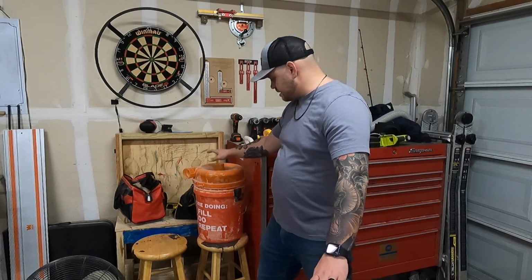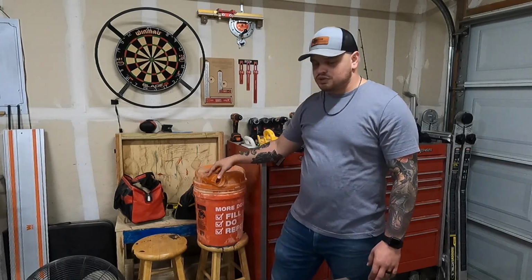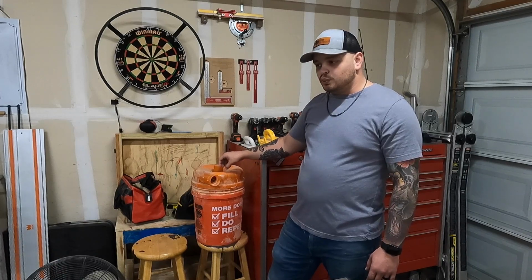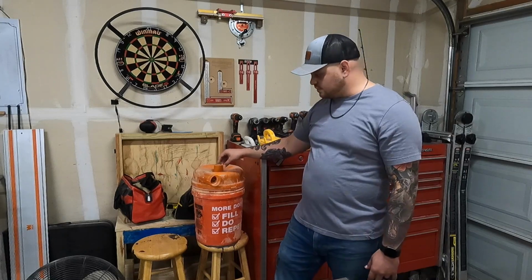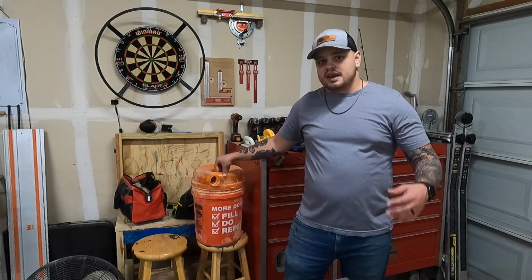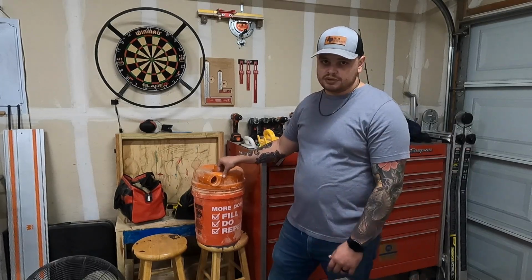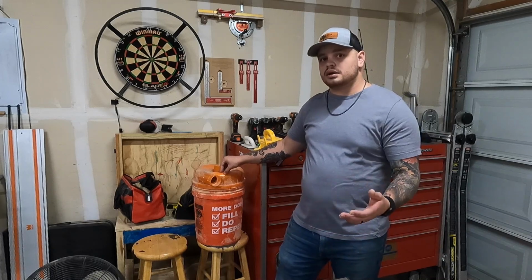And then I got my dust stopper, which was a mini cyclone that I got from Home Depot, attached to a shop vac. I like this. I would still use it if it had a bigger capacity. That's really the only reason that I don't use it, is it's only about 5 gallons. And any of you that have a big planer or jointer know that you go through that in about 2 or 3 boards. So that was just annoying, having to change it out. So I got the larger one from Rockler that we'll talk about later.